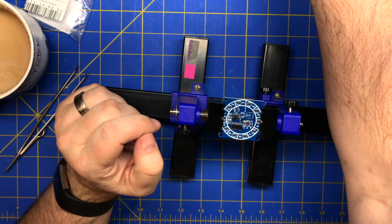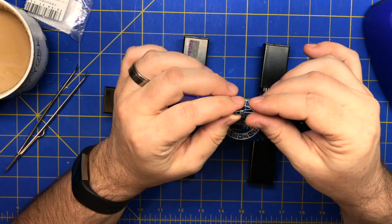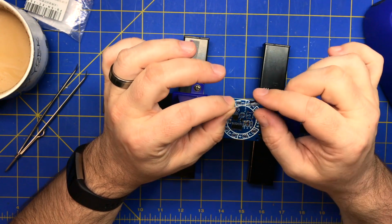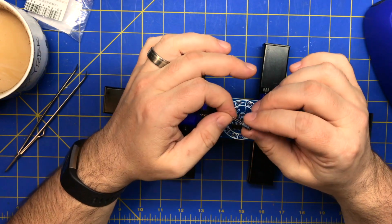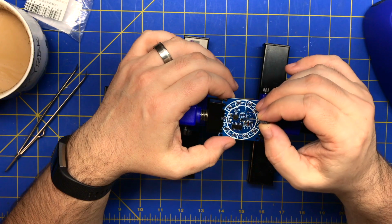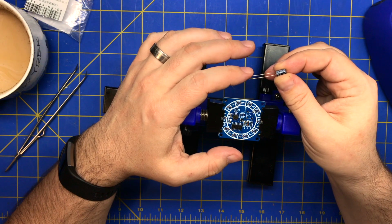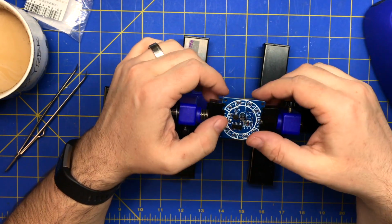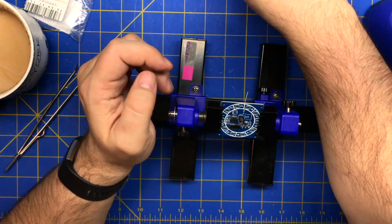So we're going to do these capacitors here. This one is a 47 microfarad. On a capacitor, the one side will have a band. It's the negative side. Here's the little plus sign, so that goes on the other side. 47 microfarad. Here it is. Positive. Also, one leg will be shorter. That's the negative. If there's no marking. Usually there's a marking. And for through hole components, I usually just bend them.